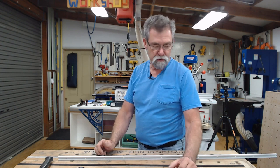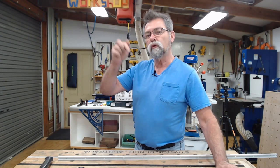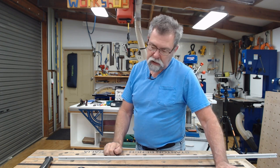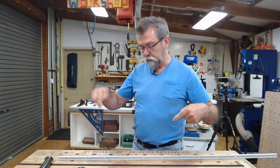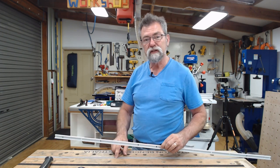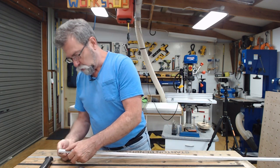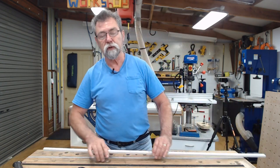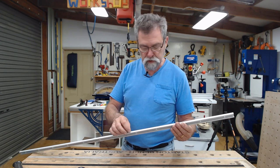Let's call it 3/4 inch ply because a lot of people watching are going to be in the States. Now I use a 4 millimeter bit for the pilot hole for these to go into. A lot of people say 5 millimeter. I prefer 4 because it just gives the screw extra bite when I put it in. Because I put a lot of pressure on this and I don't want the track to pull up. If you're wanting to put a track in something you're going to exert a lot of pressure on, as I say, this one has already got the slots and everything for glue.